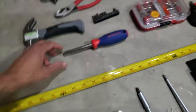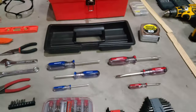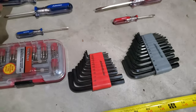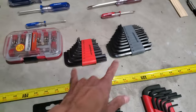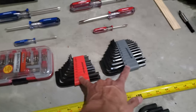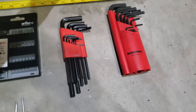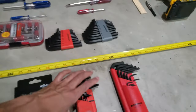At this point I believe it's worthwhile for someone in an apartment to have a full set of screwdrivers: size two, one, and zero Phillips, plus the corresponding flathead screwdrivers. And even though we had the really tiny Allen key set, if you're in an apartment with a toolbox, you should go for a larger, more extensive set of Allen wrenches in multiple sizes. The longer ones give you more leverage when torquing something large, or for reaching an Allen bolt that's further away. If the budget allows, instead of something cheap, go with something made in the US — it's pricier, maybe $20-25 versus $10 for both budget sets, but buy once, cry once.